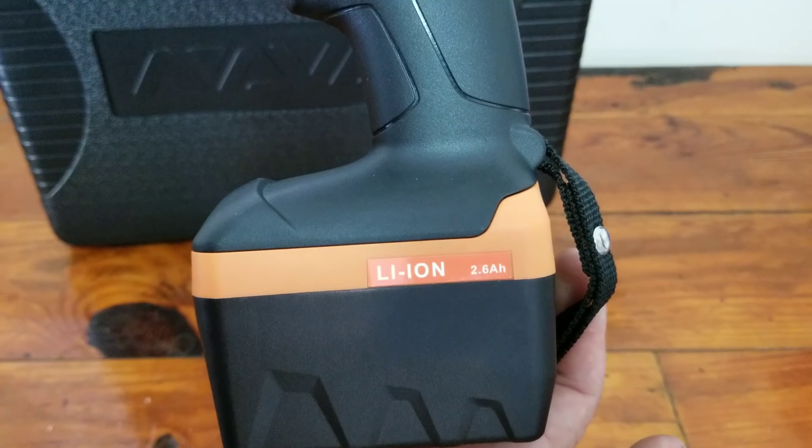You can see these little Phillips screws — just open this up and if you ever want to change the die, you just loosen that Phillips screw, take that out, and the die drops right out so you can interchange them. Super simple, very cool design. Very impressed — I didn't know how much of a fan I'd be of this product when I first saw it, but once I got my hands on it, it definitely makes super clean flares very quickly. There's not a whole lot of hoops to jump through for the flaring process, so it's just as fast if not faster than a simple flaring block, and a lot more consistent.